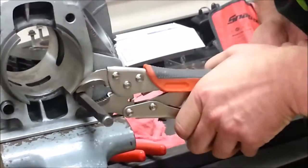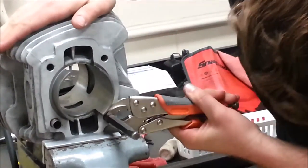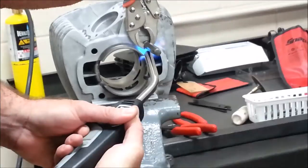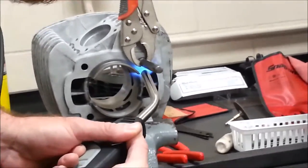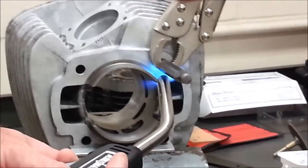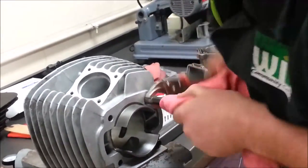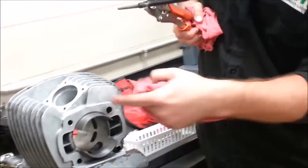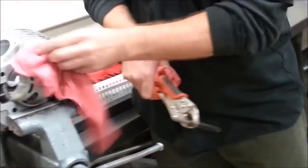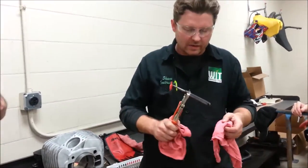Let's get some heat on there again — MAPP gas. Does anybody know how hot MAPP gas can get? Now what I'm making sure not to do is hit the machine surface — my vice grips were intentionally away from this surface so I didn't drag across the face. We were unsuccessful in saving this dowel pin, but that is a way to remove it. I do have some luck on ones that aren't super seized.